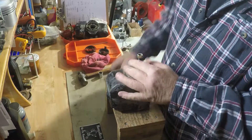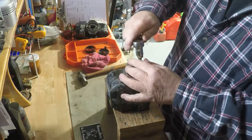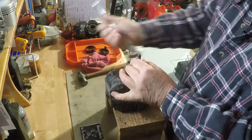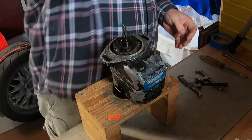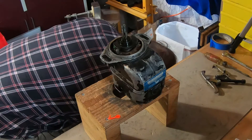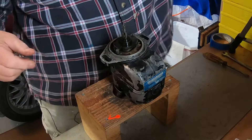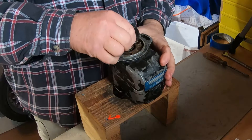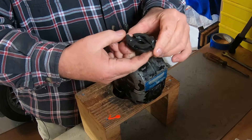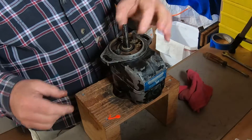Again, take the nut back off the shaft — that's just what I do. Anytime there's a threaded shaft on a piece of machinery, I typically have a slave nut in the toolbox set up for those threads. The flyweight comes off and we're checking things, seeing how they look. We'll do our clearance checks later. Springs on this are good. Overall the thing looks good — it's filthy, but it looks okay.